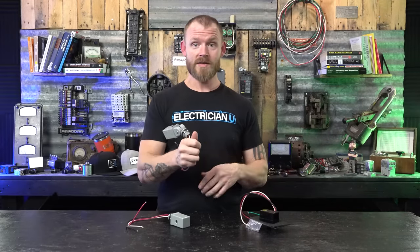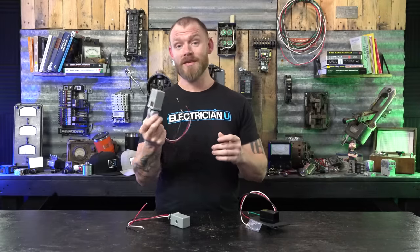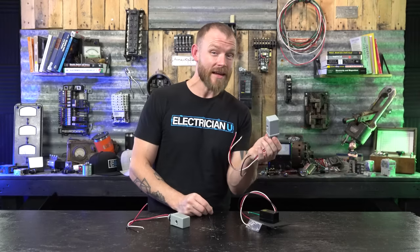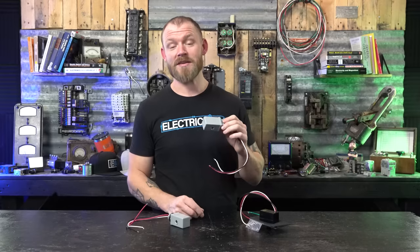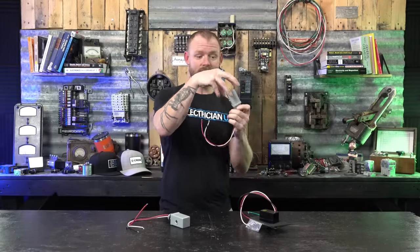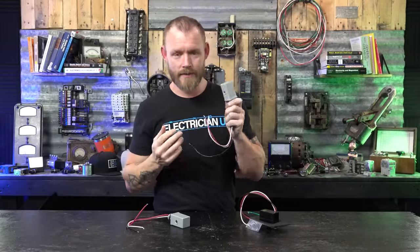Put a new one in, replace the wires, and within a couple minutes of blinding it they come right on — pretty easy fix and pretty cheap too. If you use orange tape or brown tape it takes way longer — sometimes 20 to 30 minutes — so you really have to make it dark. Some people put a box over it but light still gets in underneath. You just want to completely blind the photo cell any time you're trying to test whether something will come on.